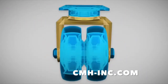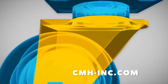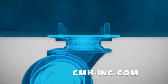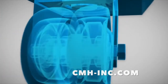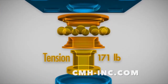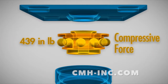So the yoke part has to be all heat treated, and this big plate with its 200 pounds is pushing down and focusing all that through the yoke on this little area down here. Now remember, this is bolted to the bottom, so the axle out here is getting just a straight up and down load, but the twisting load, as this is trying to lever off, is focused down on the swivel bearing, the radial thrust bearing in here. This side over here is trying to push up, this side's trying to pull down. And it's a non-trivial amount of force involved here with 200 pounds on top.